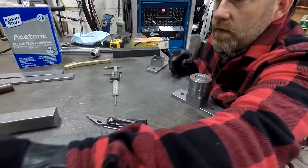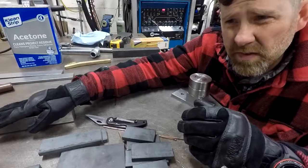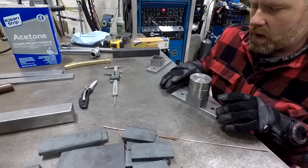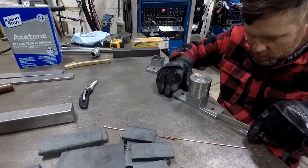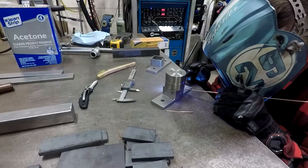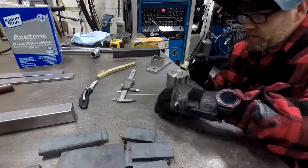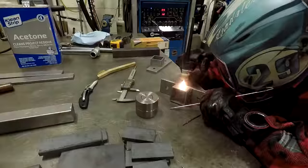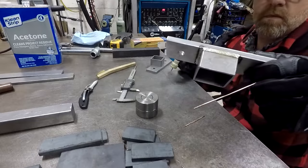I got the pieces in the tumbler — the pieces I just welded up, the box tube. One of them is still a little tight after I finished it, so I'm going to deburr it and make sure there weren't any burrs on it, because I actually sanded it a little bit. Now I'm welding up the feet — these are 2 and 1/8 inches away from the edges — and we're just going to tack them here before we weld them. That turned out pretty good for a fuse weld.